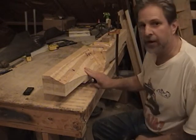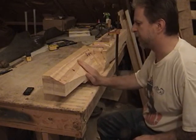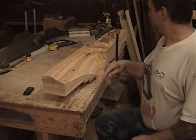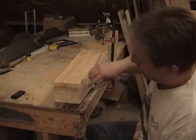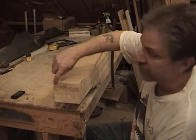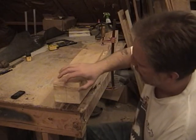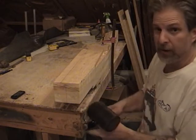As I chip this away, each of these lines becomes a depth gauge for me — the point I have to chisel down to. They break the wood up and give me a guide as I'm chiseling this face. I'm down to about an eighth of an inch from the final surface. With cedar being pretty soft wood, that'll grind down really easily. I'm going to flip the jig and go to the next face. I've drawn lines so you can see what little material I actually want to keep — a top and a bottom flat surface — and this top triangle and all this wood will come out. The prop will get quite a bit lighter when finished.